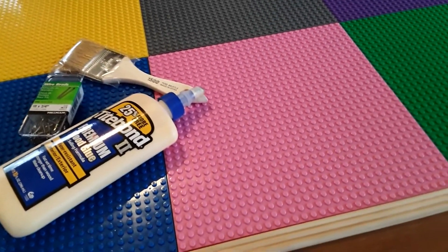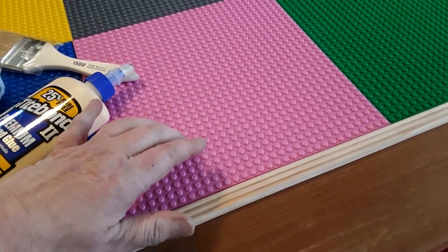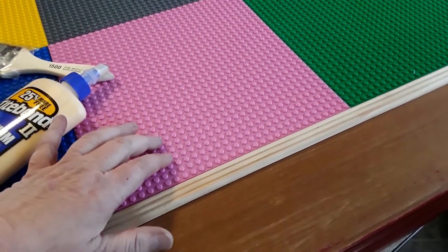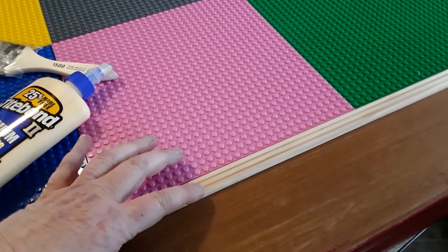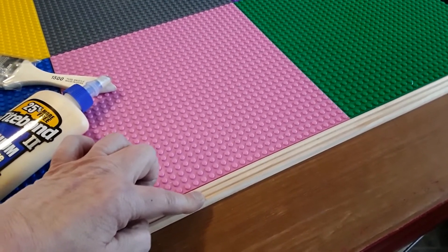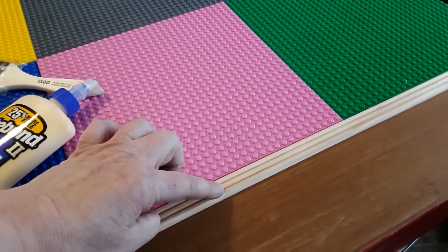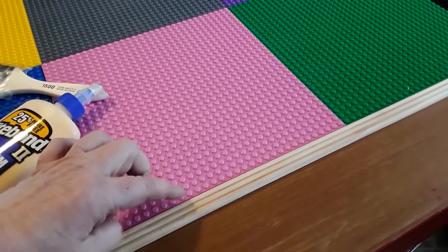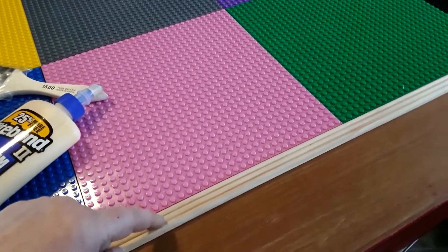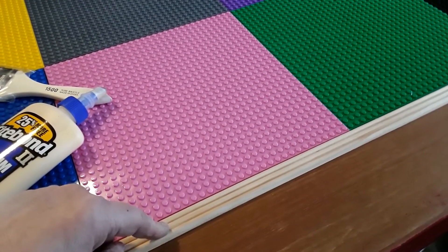The thing is I'm going to have to do some more painting, because now that these are going to be removable I'm going to paint under here — where originally I was just going to paint the outside once I put these in place. But I have to be really careful: you cannot paint under where you're going to glue the wood down because it won't stick. So I'm going to draw a couple of lines, paint both sides, and make sure it's well sanded underneath to glue well.